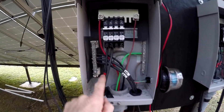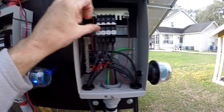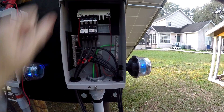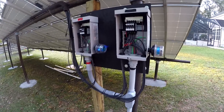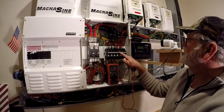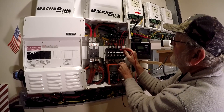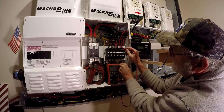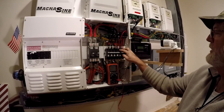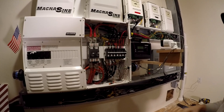I've got voltage on all of my circuits, so I'm going to go ahead and switch those on. That should bring power up to my power wall - look at that, so far so good. So that power comes into combiner box one and two, and this is the other ground mount. Let's measure what we got coming in: 127V. We got power coming in from our array - that's good. Next let's fire up the batteries.